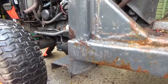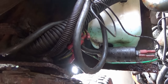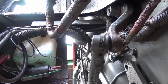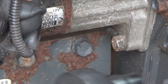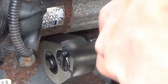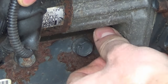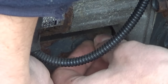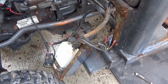So the next job is to remove all of the electricals and the coolant hoses from the cab itself, and it's not too difficult luckily, despite it being very rusty. I just need to unplug everything and then the cab will be totally free and able to be lifted off very simply. So just here, this is a ground wire for the washer bottle motor, and that obviously goes up to the windscreen wiper — so just very quickly remove this. And there we go, all of the wires hanging out.